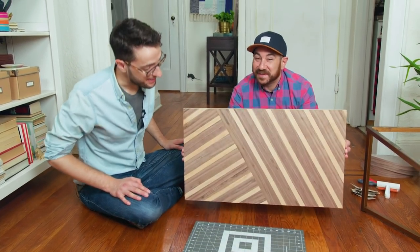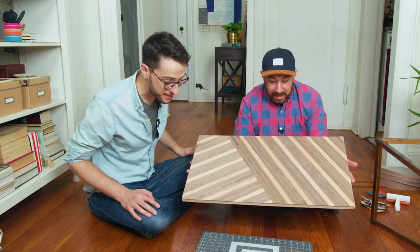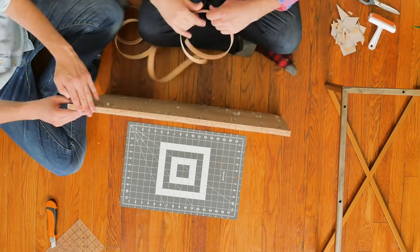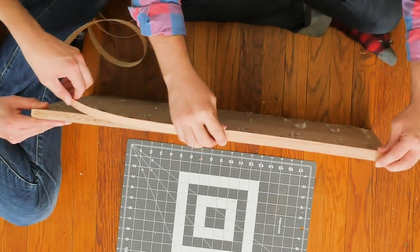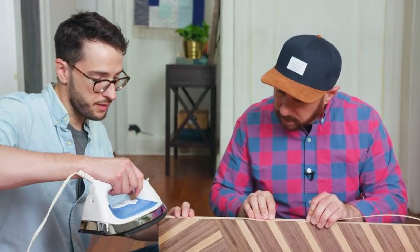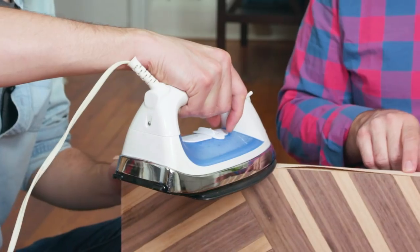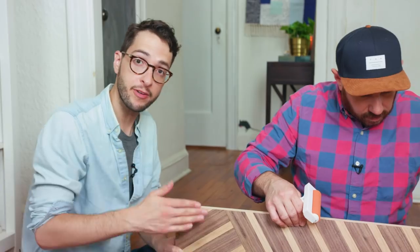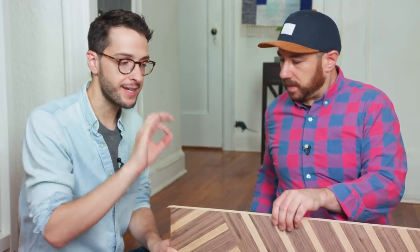Let's take a look — it looks really good, it looks really nice. It's mostly free! If it's free, it's for me. So we're going to start adding on the sides — the way you do that is you line up the top, and then the extra will be on the bottom, and then you'll cut that off. Now we're just going to iron it on just like the others, and then roll. If you're having trouble lining it up on the top, if your veneer isn't cut perfectly straight, don't worry because you're just going to sand it on the top anyway, so you'll get a nice crisp line.